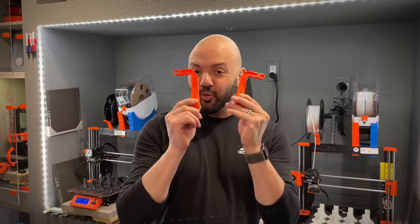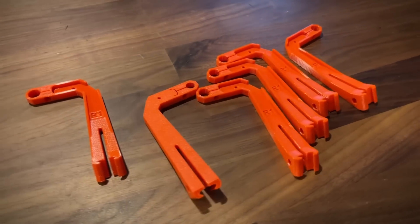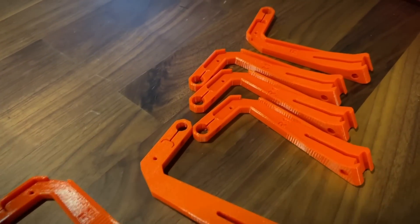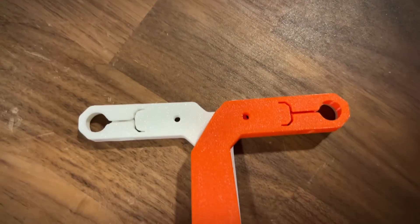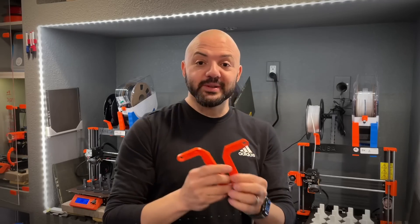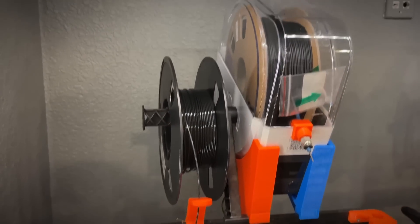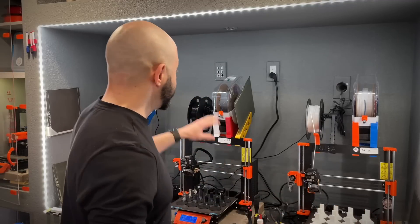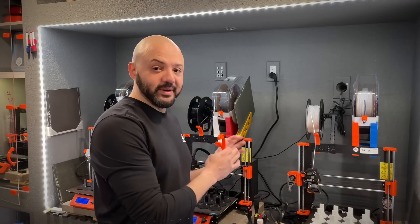Now, I printed a bunch of these one-sided versions. I actually found there's a remix on Printables.com — another user went ahead and created one of these, though I only found that after I created my own. Really, it's just cut in half. I use these one-sided ones because I've got filament drying boxes on most of my printers that are not in some sort of enclosure. I use that dry box because I have a lot of humidity in the summer that I want to protect the filament from. I also have my TPUs in there all the time because they need to be really dry.